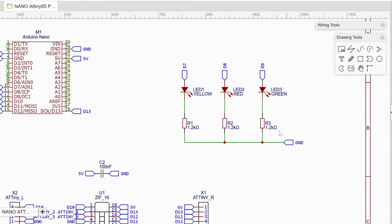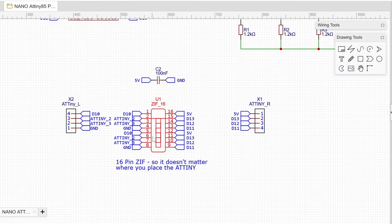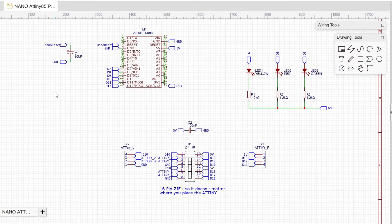There are some LEDs for heartbeat, error, and programming status. The LEDs are 3mm through-hole components — you could use SMD if you like. There's a decoupling cap for the supply voltage and a DIP-16 socket, because the ATtiny85 is an 8-pin CPU so you can fit one on the lower side and one on the upper side. The little connectors are simply test pins so you can probe CPU pins in circuit.